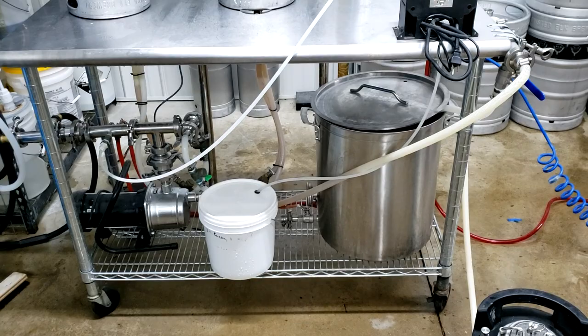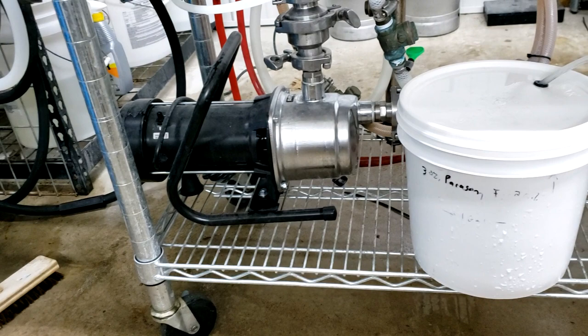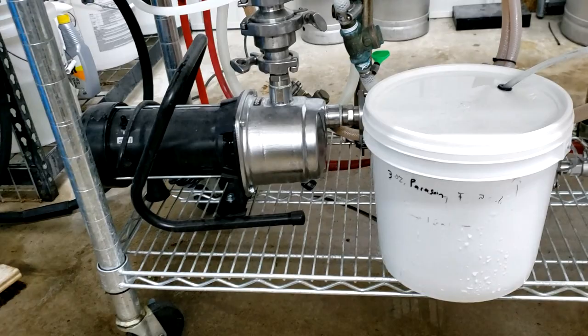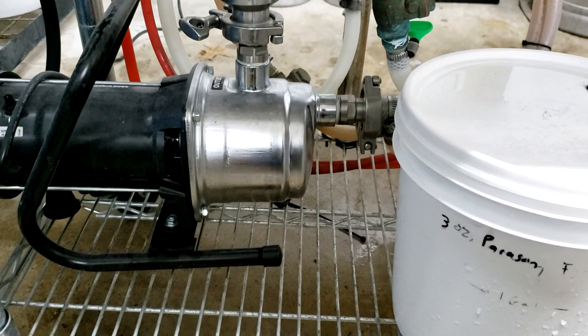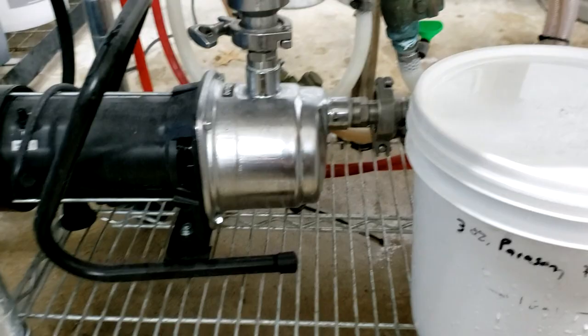This is the back of our keg washing machine. As you can see, we have our pump down here. I found this stainless steel pump — it's actually a lawn sprinkler pump, but it's got a stainless steel head in it and it's very powerful. It worked great for this application. I was able to find adapters and I decided I wanted to go with tri-clamp fittings so it'd be more universal. It probably would have been cheaper with pipe thread and threaded fittings, but I wanted to interchange some parts, so I went with the tri-clamp system.